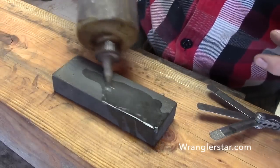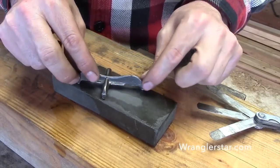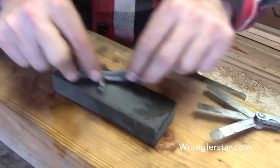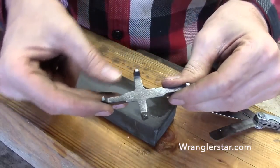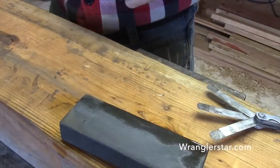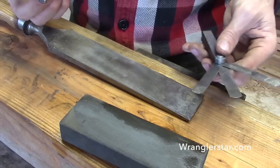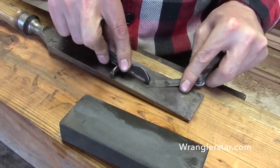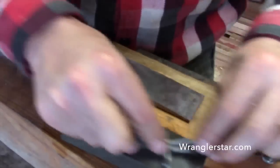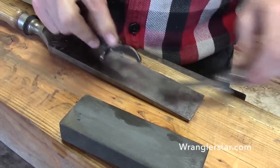We'll take these down on a little stone - just your regular traditional filing stone, coarse-fine, you probably have one. We don't want to touch the long part but push it back and forth a little bit - a little goes a long way. You can see we're polishing those three bottom feet, taking that down just a little bit. No hurry - keep checking with the twelve thousandths feeler gauge.